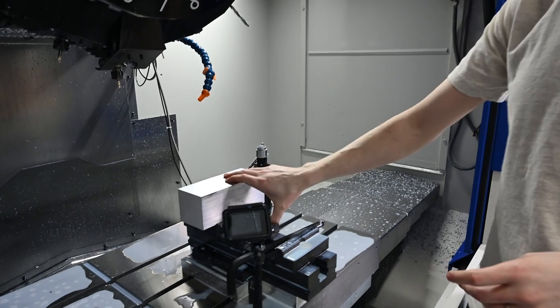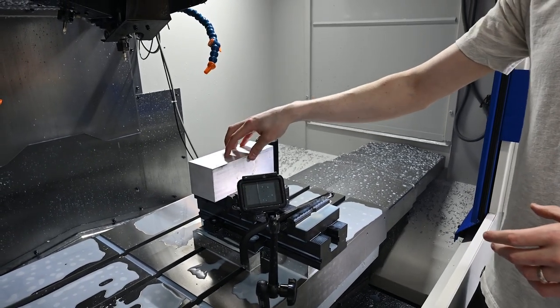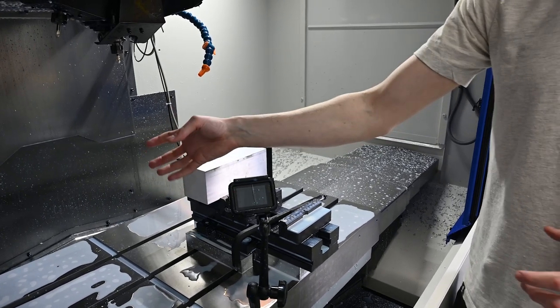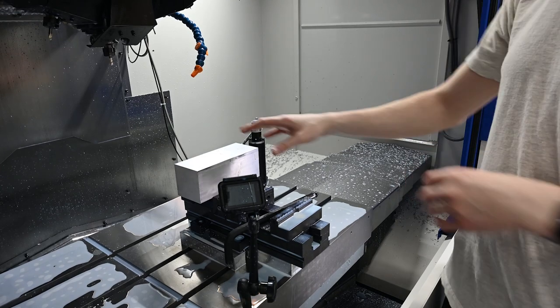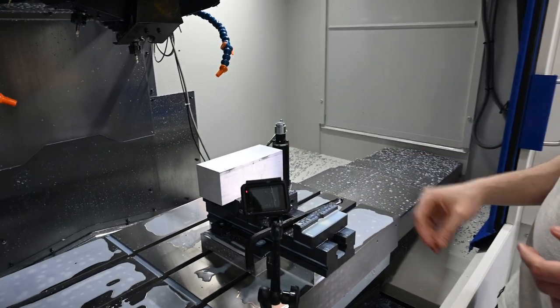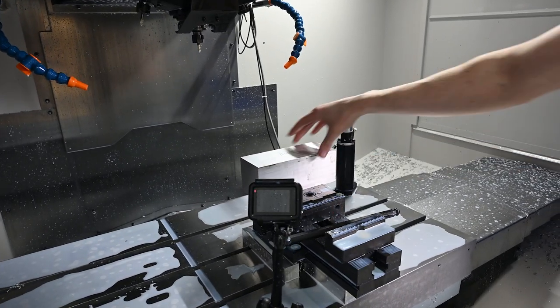This is going to be the side of the table that connects to a side spindle, support spindle, basically, that's going to be off to the side to make sure that the trunnion table is supported on both sides, the rotary side and the side spindle. So that's what we're working on now. We're milling it out of a big chunk of 3-inch square stock.